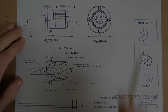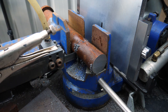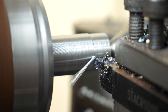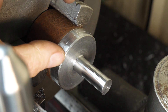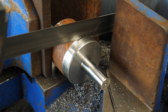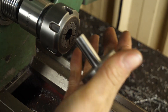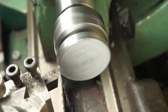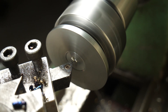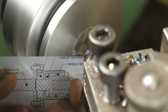Let's start off with this backplate. I've skimmed off the surface rust, now to turn the shank. I've sized this shank to be the largest size that will fit inside my tailstock. I scribed a line with my lathe tool just so I've got a bit of a guide in the bandsaw. I'm now cutting a divot in the backplate. This divot is to allow a bit more clearance on the spindle, making the tool more compact and shortening it overall.